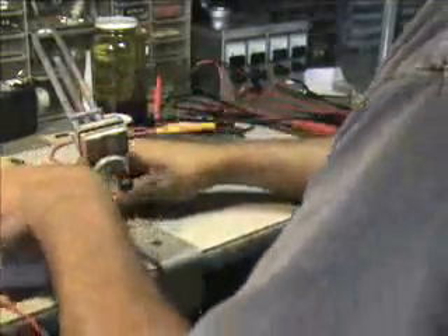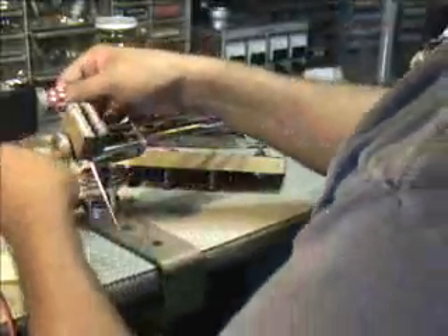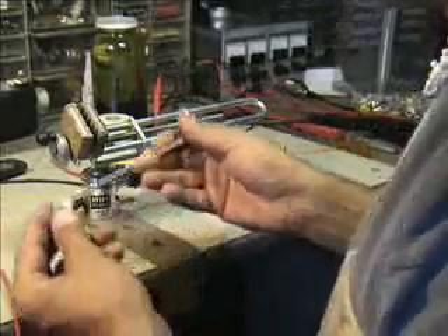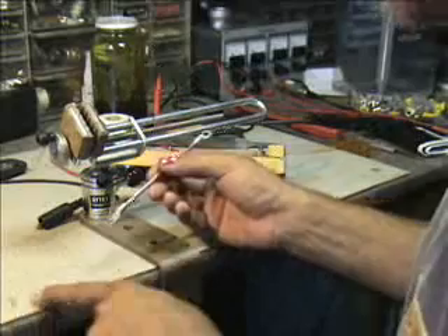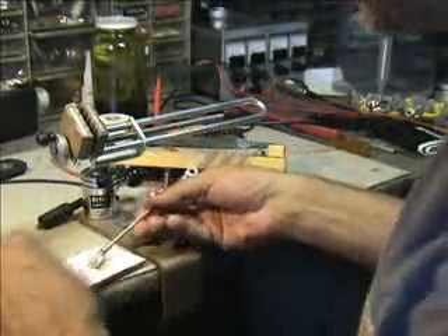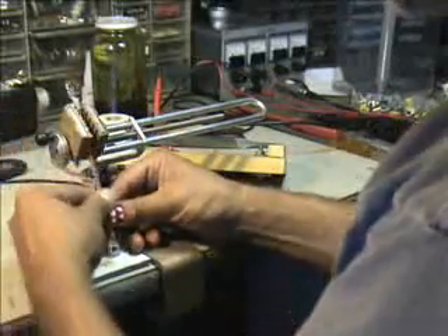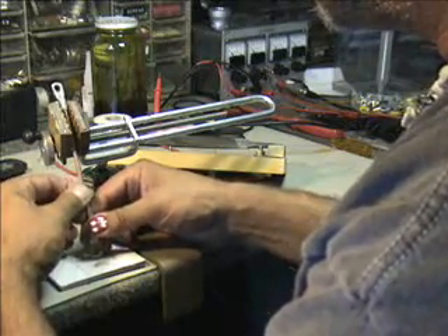We can't jig this up such that it's going to get hot. So what I put together here is for when I solder lugs and such things — you've got to get them pretty hot for the solder to get down inside there. I burnt my mat up plenty of times, so I made a piece of ceramic. This is a ceramic tile that I've soldered together to make a nice heat shield for soldering, just for this type of application. So I can go ahead and get it as hot as I want and it is not going to melt my mat.